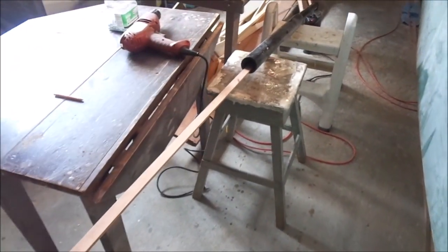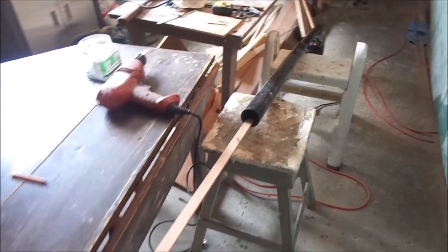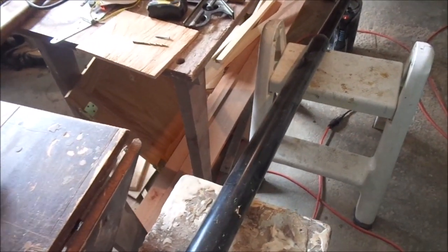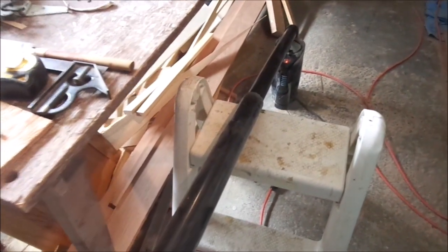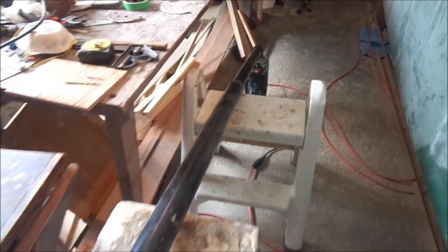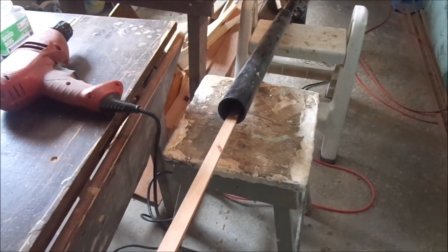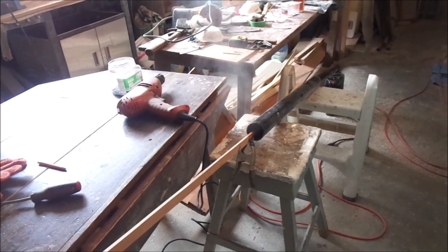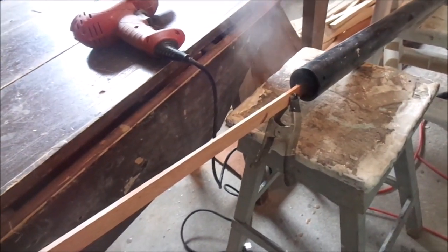I'm back to doing some steam bending. This is a piece of cherry I'm going to be putting on for trim along the front of the canopy. Because of its length, I've added a little extension piece onto the PVC pipes — just overlapping it to have a telescopic effect and allow it to steam right up past the halfway point. It's about 5 minutes into its steaming process and seems to be working quite well. I've added a little clamp on the bottom of the wood just to hold it in a vertical mode.